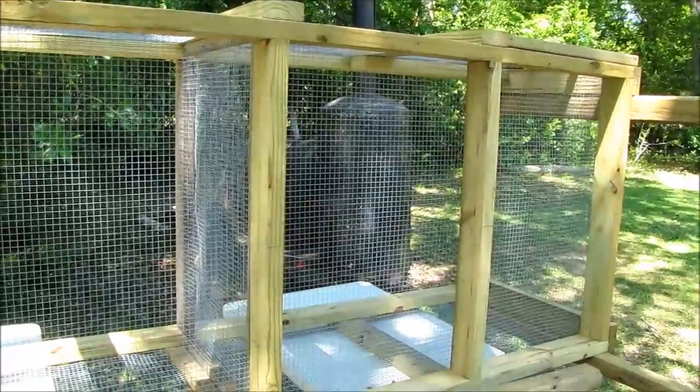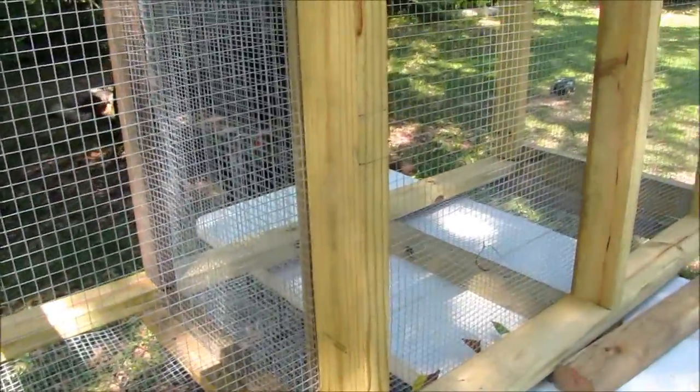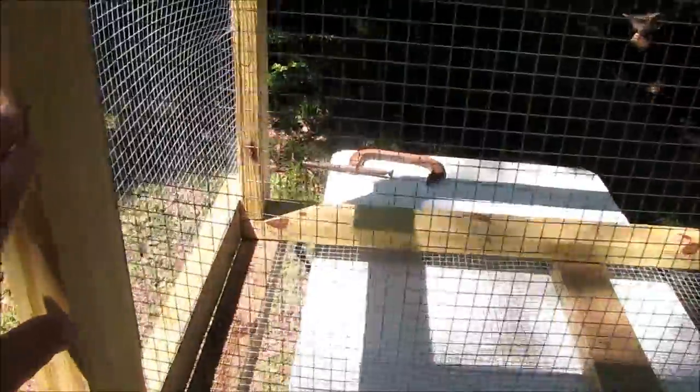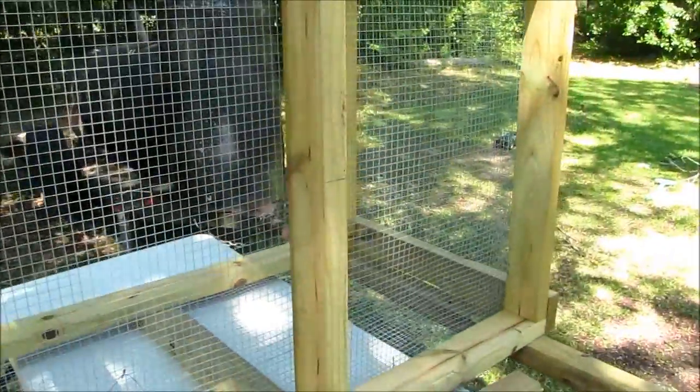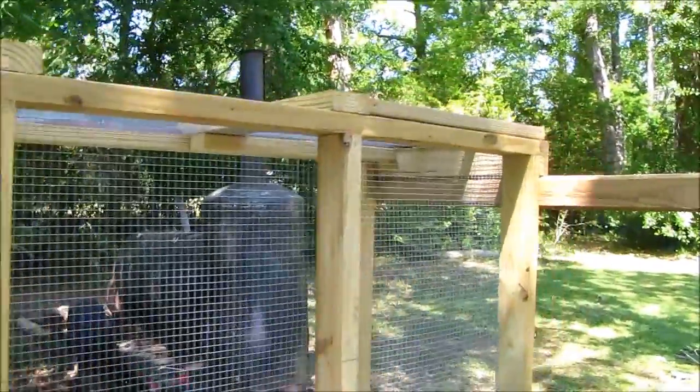Now, are you going to put these crosswise? Yeah, crossways. You got to trim them a little bit. Yeah, I got to cut a couple inches off of each one. I got to measure them and cut them off, and I'm going to use the long 3.5 inch screws to go through here and into the board. Okay. Yeah, it's going to work out well. Then we'll be ready to turn it up, finish the trim, and put the other door on.